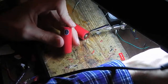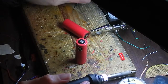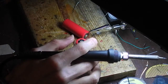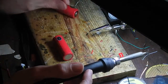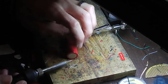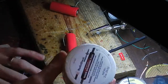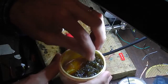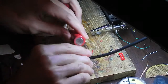By this time your soldering iron should definitely be heated up — it is. I'm going to turn on my fan because I get affected respiratory-wise by breathing solder fumes and aluminum dust, so I have to protect myself. I have one of these charcoal fans that keeps the fumes out of my face. Now just take your solder — we want to pre-tin this. You basically want to get the surface hot and then apply the solder to it while it's hot and spread the solder around. Another thing that helps is flux paste — you can get a big jar of this, it'll pretty much last you a lifetime. Dip the end of the solder in it just a tiny bit and smear it before you start soldering. That helps the solder spread onto the surface.